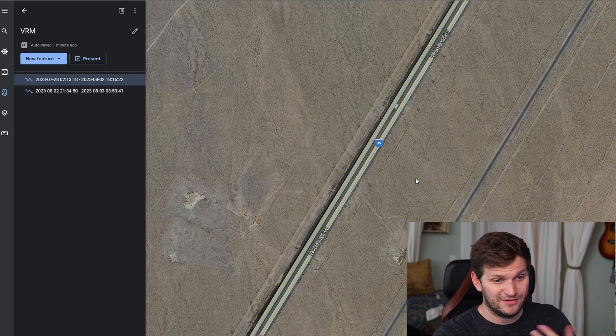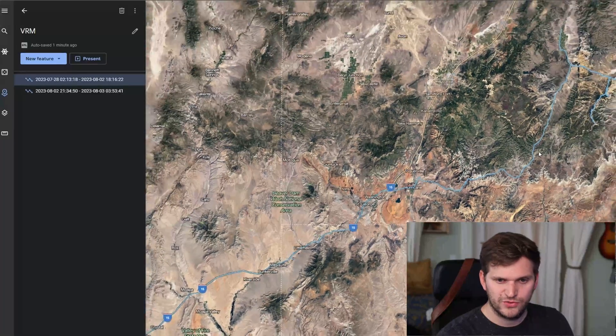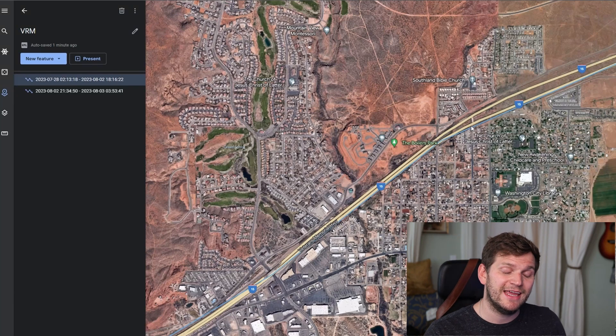That's an accident that can happen to you. When I zoom in here on the route back on Highway 15, we can see it's still just one line. I hope you learn from my mistakes. The Venus OS installation needs a constant internet connection that uploads everything to the VRM portal — otherwise it's not visible there. And coming back to a question from a viewer about whether data is stored offline — not really, maybe up to a point. Someone mentioned there's up to one megabyte that stores, but I have no idea if that's accurate. So for me, this is proof enough — if there's no internet connection, I'm losing data. Not only GPS, but all data it's collecting: battery status, how much solar power is coming in, and so on. Keep that in mind.